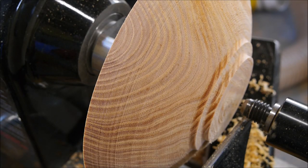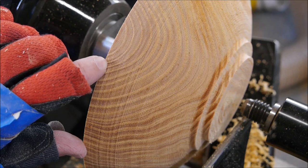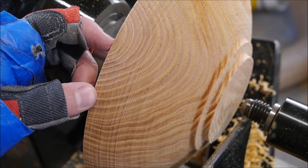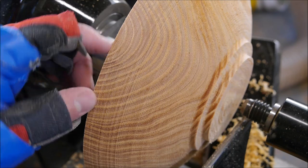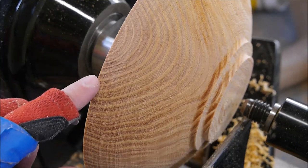I'm going to have a break in the action here to talk about a couple things. First, when you're turning green wood, you're in a race against time. You can see already here where I've got a little crack propagating. That probably originated from the pith, and I probably didn't quite take as much out of the center of this log as I should have. So I'm going to have to make this bowl about that much shorter, or take a couple more passes to get down past that crack.